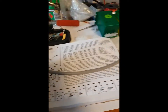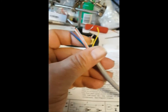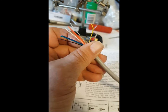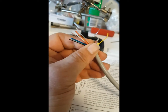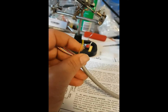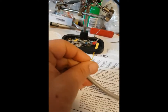But at Jaycar, I found this 9-core wire. And now you're thinking, well, you've got an 8-pin plug, why did you get a 9-core wire? Well, it's reasonably simple. These 8 wires will be soldered onto the block, onto the pads. My yellow wire is there as a spare,